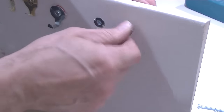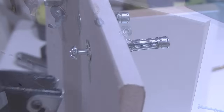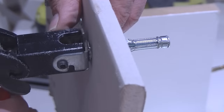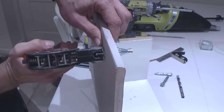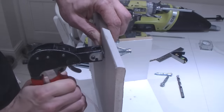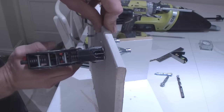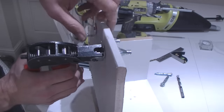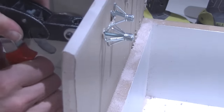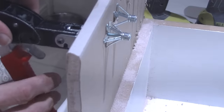This time we're not so worried about having the turning stop. All we need to do is remove the bolt just a little bit to enable us to get the setting tool into position. Now what we simply do is start levering away on the setting tool. We don't need to worry about the claws on the anchor in this case because we're applying a different motion and so the claws don't need to bite. And then the anchor opens beautifully behind the plasterboard, and then I simply pull this lever to release it.